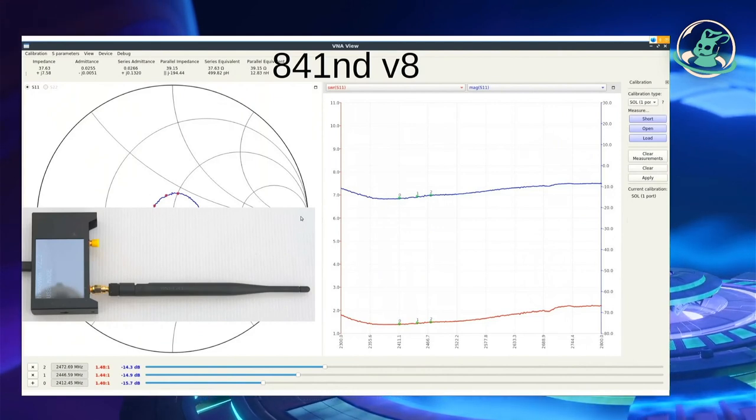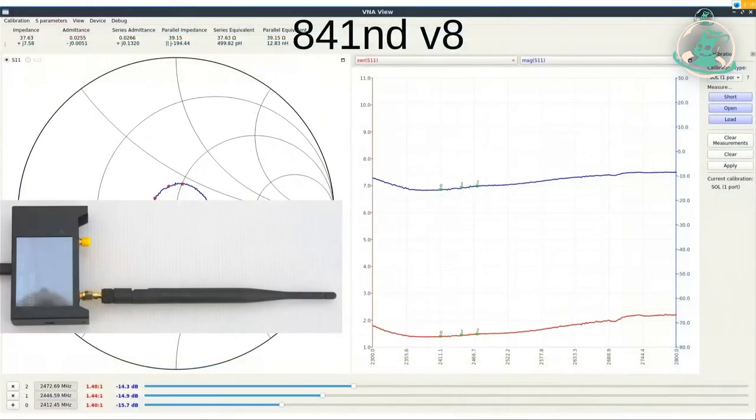Here's a low-cost classic: a router for 15 euros that includes two antennas. WiFi antennas use an inverted SMA plug, so you need an adapter, and that should be a proper one — otherwise your measurements will not be accurate. Now we see two colorful lines, both for port S11. We see what gets reflected back, and we don't want this reflection. All the power should go via the antenna into the air and not be reflected back.